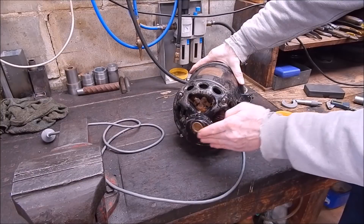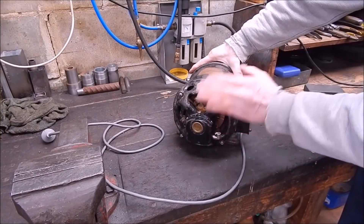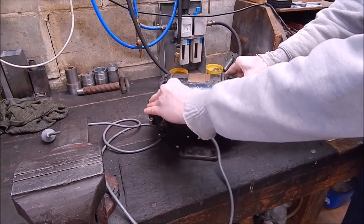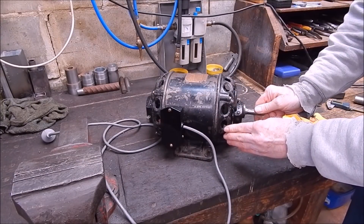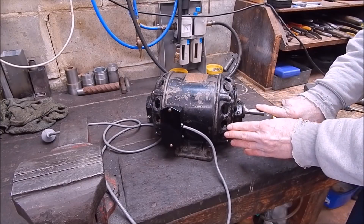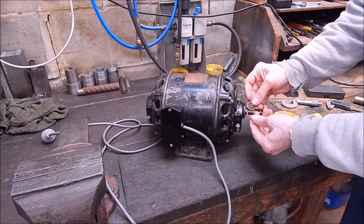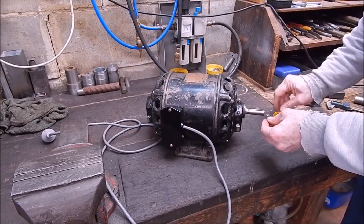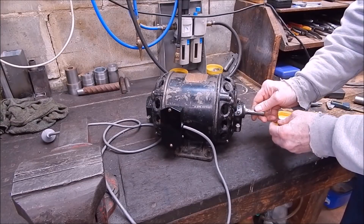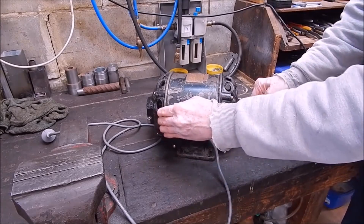The bushes are good radially — no wear whatsoever radially. There's a bit of wear, a bit of end-play; the shaft goes in there a little bit. On these armatures they shim the shaft with some fibre washers, and these two are broken and worn out, so I've got to shim it on this end so that it pushes the armature back that way.